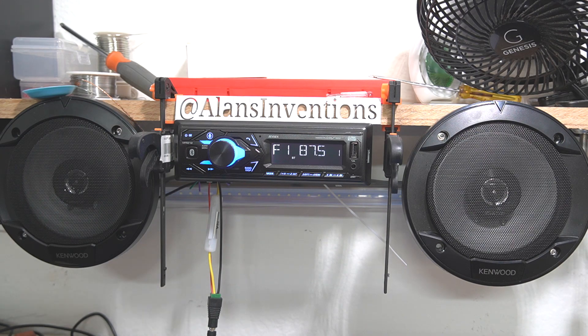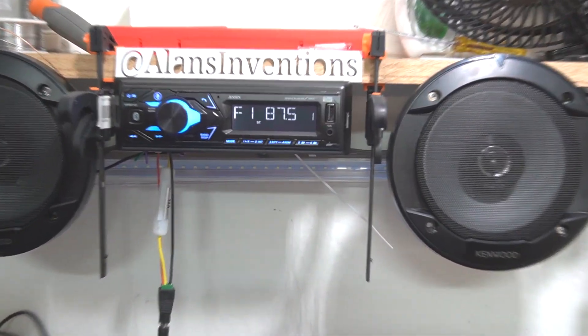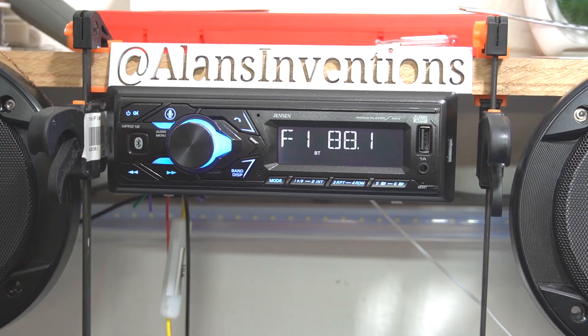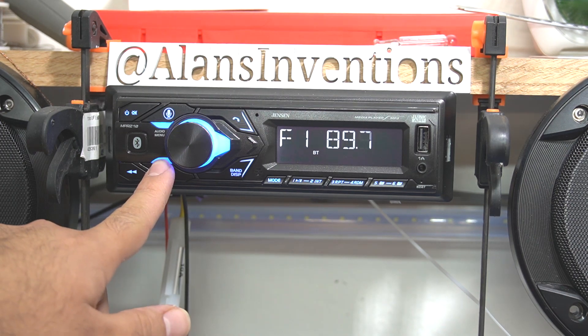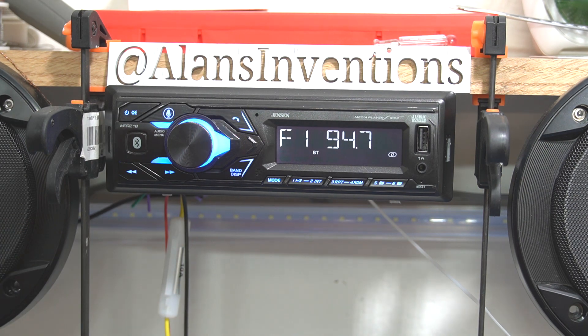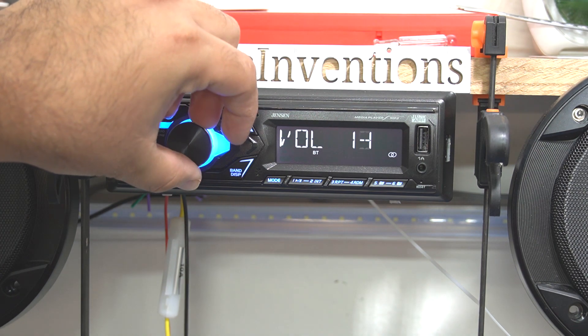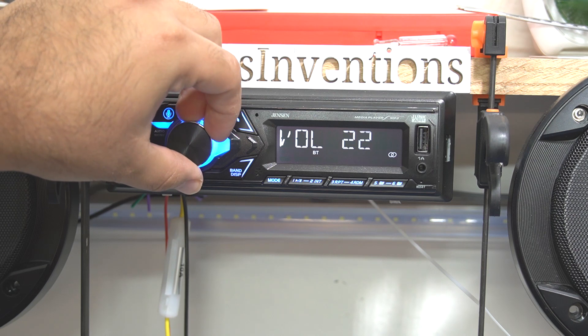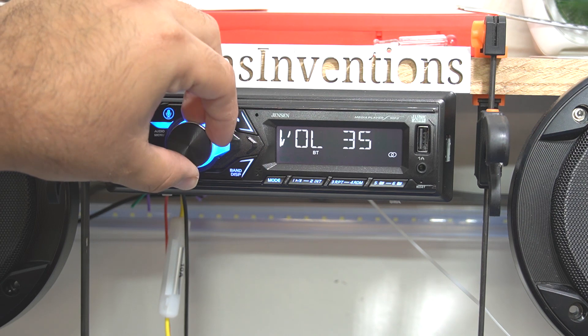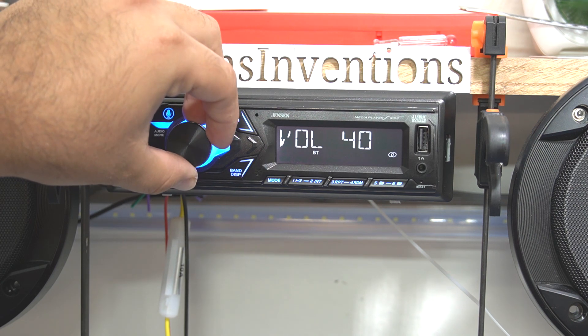I'm still debating if this is going to be the stereo I'll use for the bigger project I'm working on. If I do, I'm going to have to find a way to supplement the power — this power bank is only rated for 60 watts and the stereo is rated for 200 watts, 50 watts per output. I have to do some math to figure out how much it's really going to draw, but wiring it up as-is is a fire hazard — something's going to burn out eventually. For now I've got to keep researching power banks and maybe find other stereos with good quality output that's loud enough for a party. Anyway, thanks for watching — see you guys in the next one.